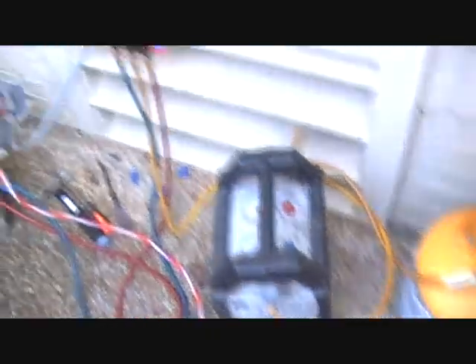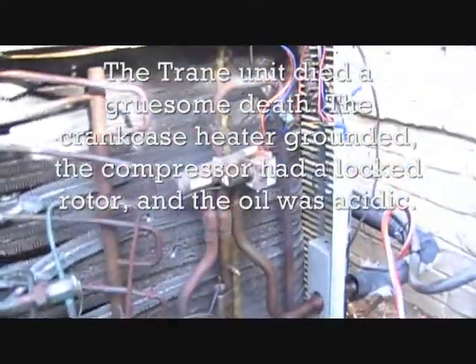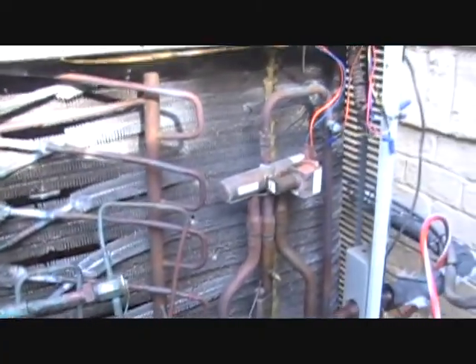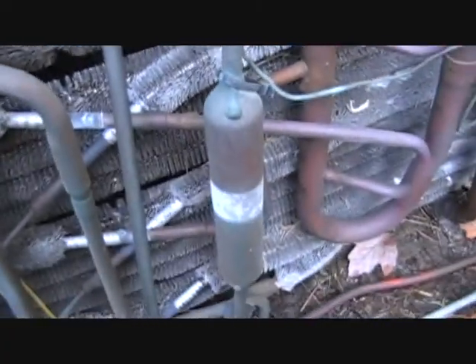We are recovering the refrigerant from the Trane system — a 4-ton XC1200 12-SEER heat pump. There's our reversing valve, manifold right there. This is our TXV, defrost controller, new contactor — 521 — and a dual run capacitor. This thing is going bye-bye.